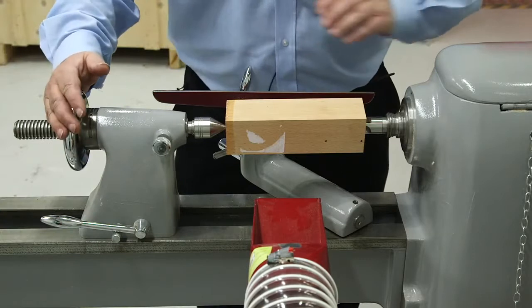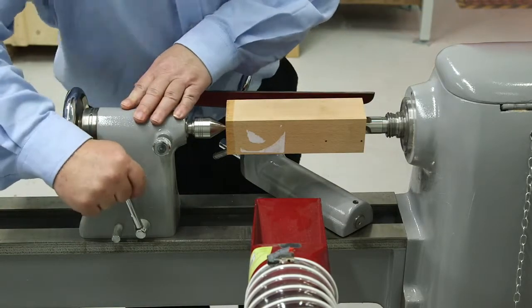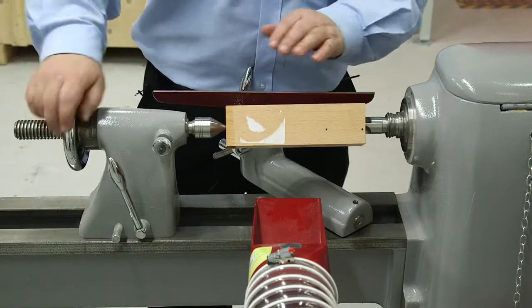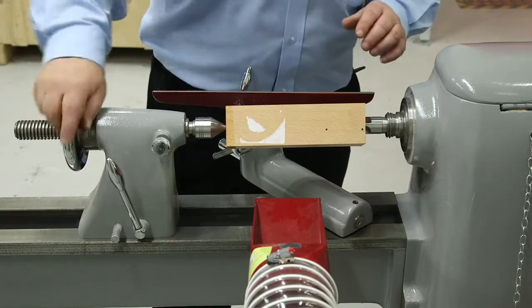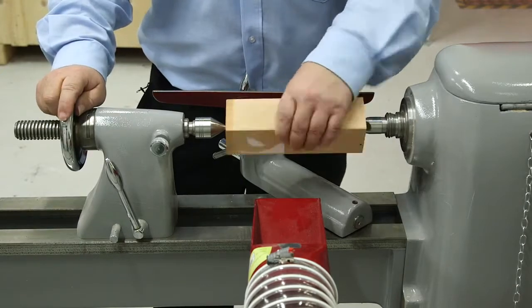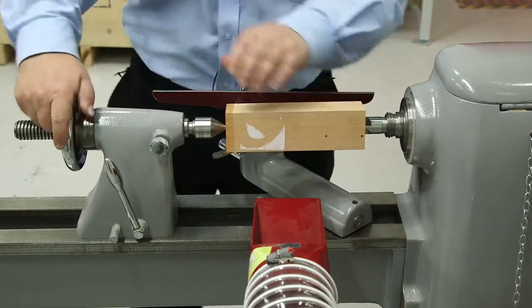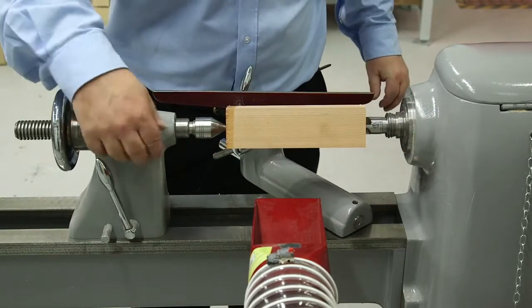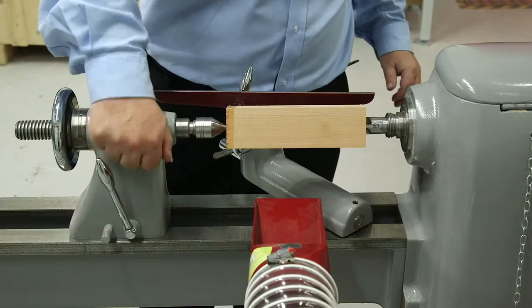Okay then, we've got the tailstock in position, locked in position. Those are set on the centres, but that's still turning, so we need to engage that and do him up so that he's nice and steady on there. Okay, we'll tighten that up so that there's no vibration.